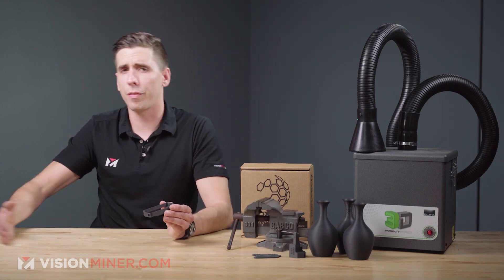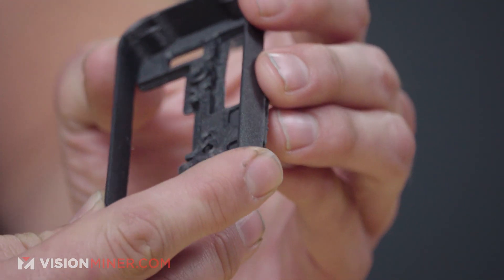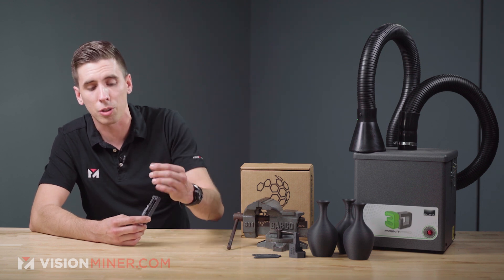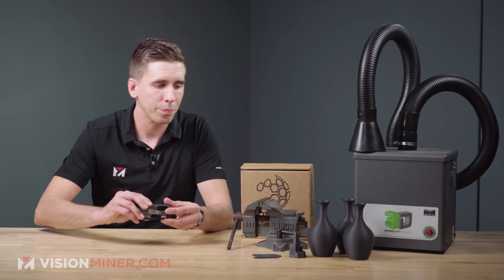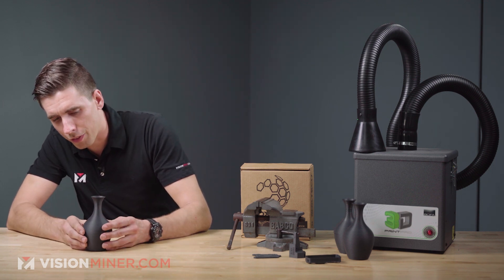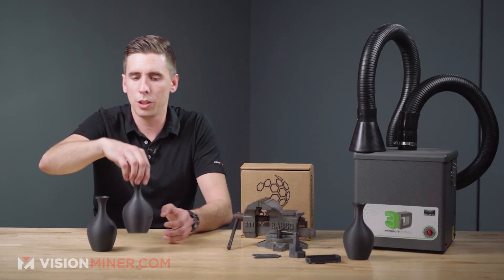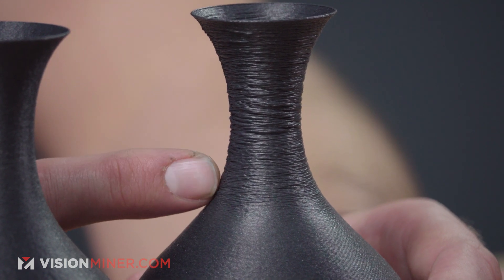Here's an electronics enclosure we've printed in every single material — we'll do a full review video comparing all of them, so hit subscribe so you don't miss that. As you can see it captures details very well. Using packing tape on the bottom you do get some warping, but you can add geometry to the bottom of the part to keep it down to the bed better. Moving along, the vases have a very nice surface finish — smooth, matte, clean. You do see some discoloration in rings throughout the part, and if you print too hot you get a lot of drooping near the top, so dial in your settings.